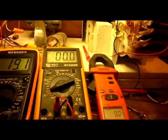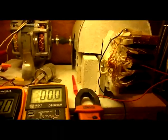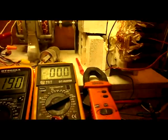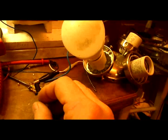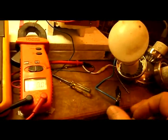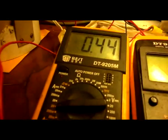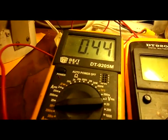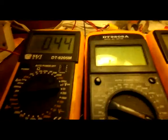And if it's too long, I can't use it for powering these loads. Now I might be able to use it on other loads, but I'm trying to power an isolated, certain load. Now I'm going to hook half the coil up. There it goes, see, half the coil. And that makes it pull down a little bit at this RPM. See that? Pulls down a little.